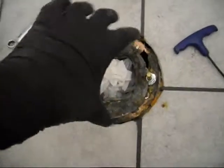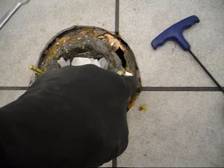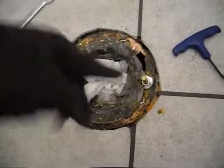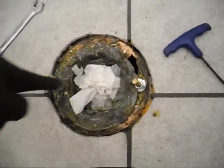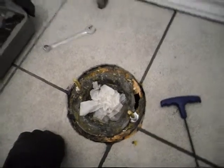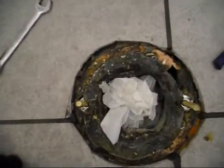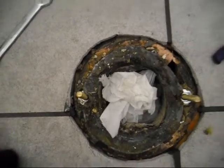See, this flange should have been installed, this ring should have been installed so that the slot ended right there. So that these are in a proper 90-degree spot or equidistant from the wall. You can measure from the wall. Should be at least 12 inches, bare minimum. I put it at 12 and a half or 12 and 3/4 so I get a bit of space behind. Sometimes the reservoir sits a bit crooked, so those are dead center, kind of sort of.